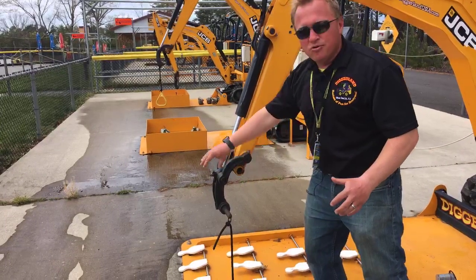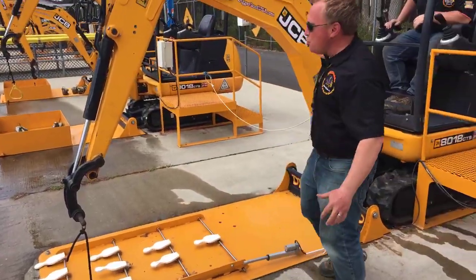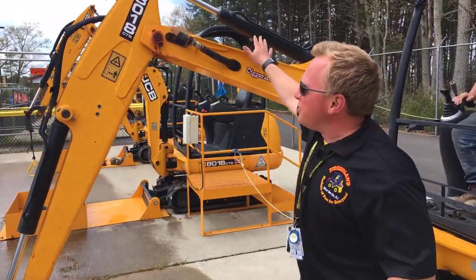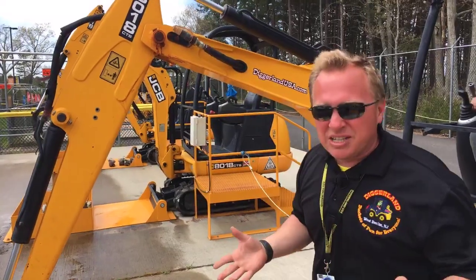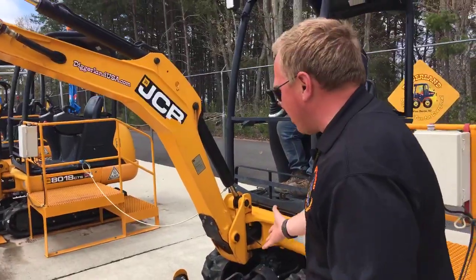So Ben was able to move the bowling pin by retracting and pushing this ram out of this hydraulic cylinder. Then he's able to bring the boom up and down by using this cylinder right here. And then finally, he can bring a stick forward and backwards with this hydraulic cylinder. Now you see there's some other hydraulic hoses. Well, we can have all kinds of attachments. We can have a grappler at the end of it, and some other equipment. Down here, we also have our tracks and our blade.